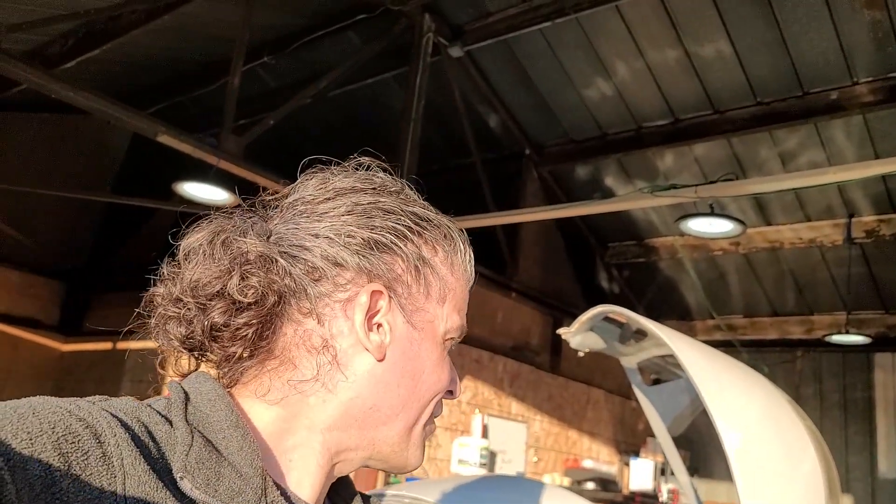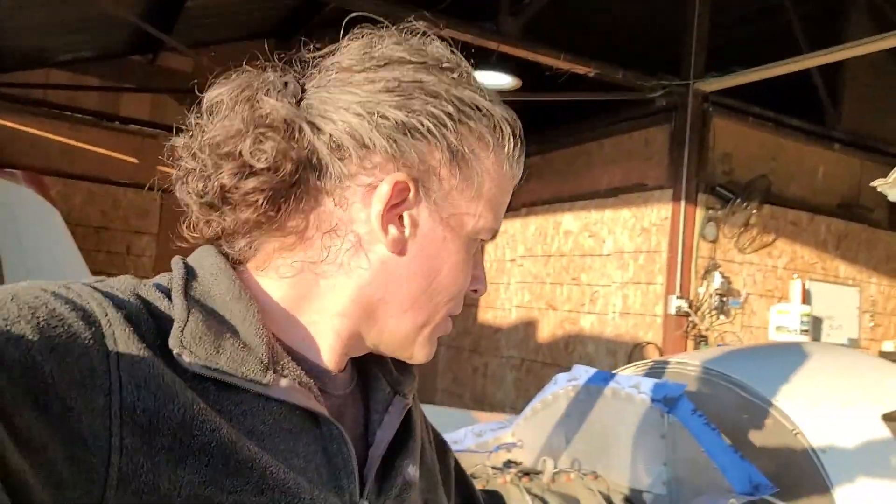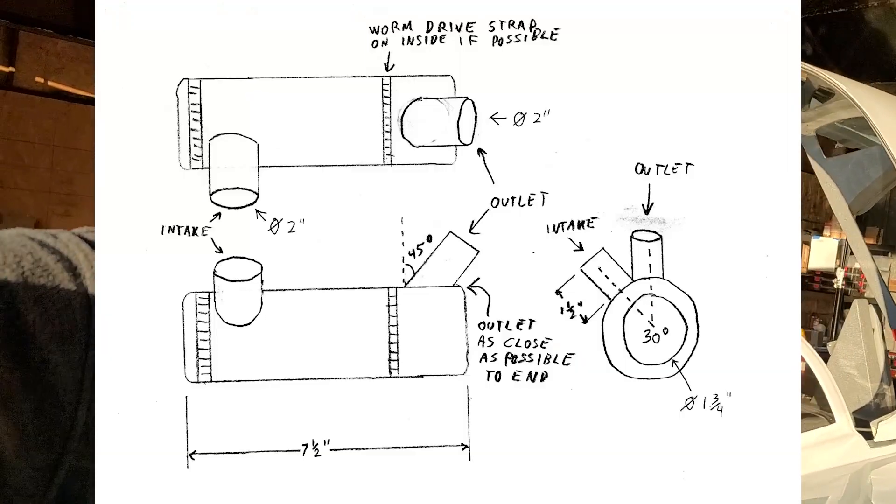I know I said I wanted to have the airplane done in a month and flying again, and I thought that was a pretty lofty goal. But having seen what I saw today, I think it's entirely doable. I do have to get to work on the circuitry of the relay board, and once I get all the parts for the nose gear I'll get to work on that. The airplane is definitely coming along. I do need to get started on the heating duct work, but I have not yet ordered the heating shroud. I talked to the guy that makes them yesterday — he wants a three-view drawing from me. So I've got to draw up a three-view drawing of the shroud I need designed, and he'll get to making that. Hopefully that will get happening this week and we can wrap up the heating system on the Cozy.